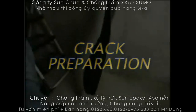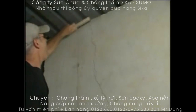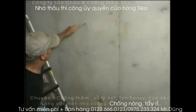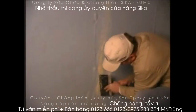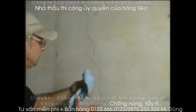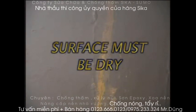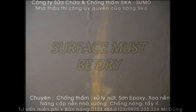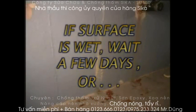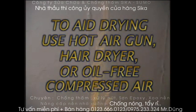Crack preparation: Place the drop cloth on the floor in front of the work area. Clean the surface surrounding the crack using a wire brush. Remove loose or flaking concrete, efflorescence, paint, or coatings to approximately 1 to 2 inches on either side of the crack, then wipe the surface clean of dust and debris. The surface must be dry for proper installation of injection ports and surface seal. For best results, if the surface is wet, wait a few days until dry, or if necessary use a hot air gun, hair dryer, or oil-free compressed air to dry the wall.